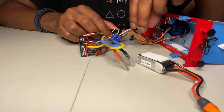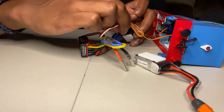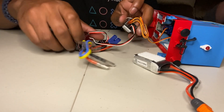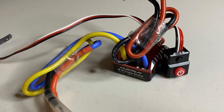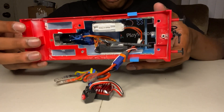You're gonna want to have the motor powered off of the same controller, because I was a complete bozo having two things powered off two different power sources. You're going to need a speed controller — not a speed controller-receiver combo, since you already have a receiver. The speed controller allows you to power the receiver along with whatever else is connected and power the motor. I also attached a piece of Velcro to both the receiver and the battery so I can stick them onto the sides of Thomas' body — easily removable. I'm all about that removability.